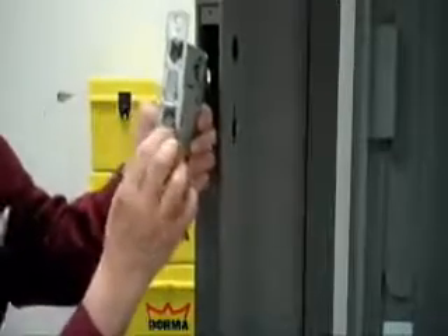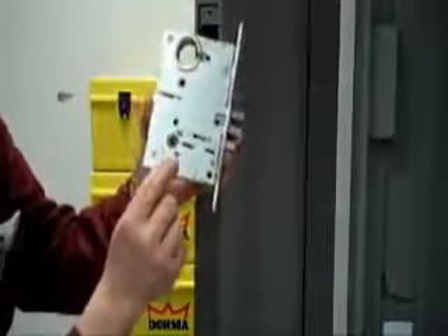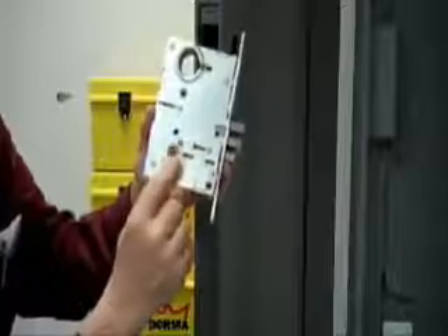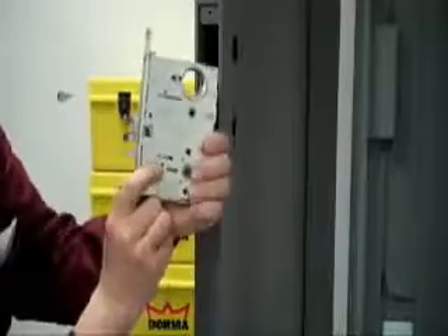The way that I know that is that the curved surface of the latch is matching this swing, so that the curved surface will hit the strike and retract. The other thing is these two screws that you see here on the inside of the case — this indicates that this is the unlocked side of the door. We do want the unlocked side of the door facing the inside.